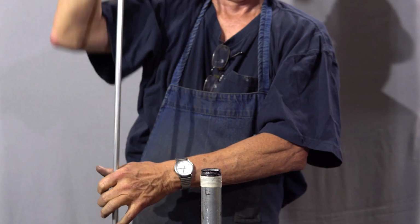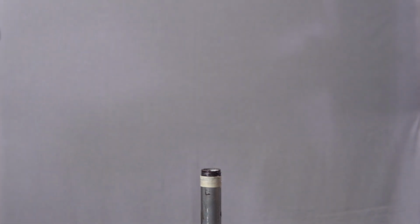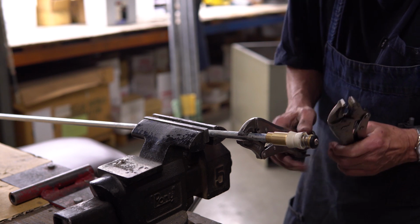With the guts removed from the hydrant, turn on the water supply for a couple of seconds to flush out any debris that could be caught in or around the valve body. Now do a visual inspection of the plunger for damage, and replace the plunger if necessary.